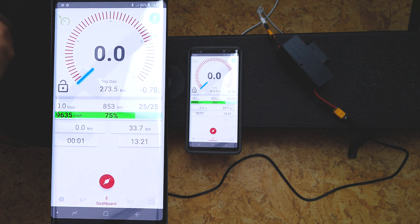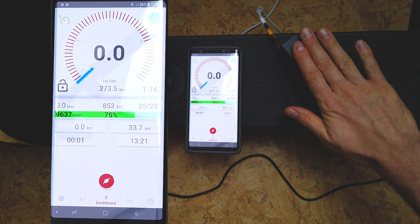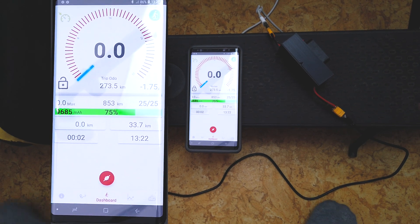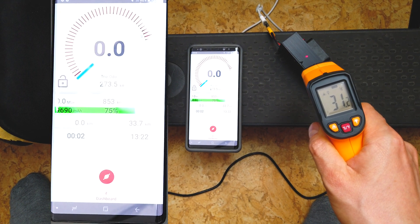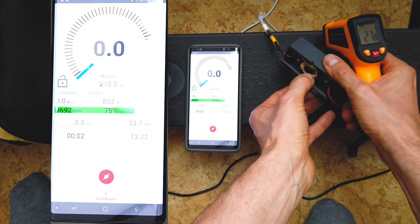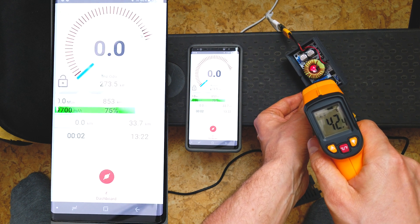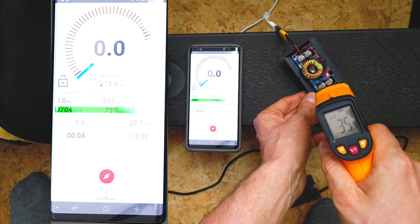When I disconnect the extra battery, it's working at full power all the time. The case is quite cold. Let me get my laser thermometer. The temperature of the shell is 31 degrees, and the temperature of the electronics inside is 45 degrees maximum. So the core is about 45 degrees — all good, it's safe to use.